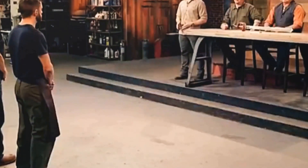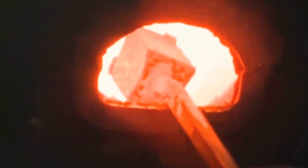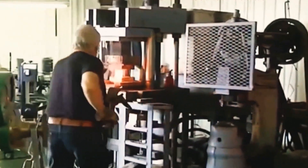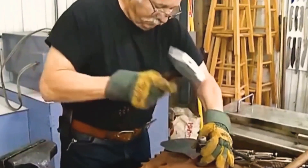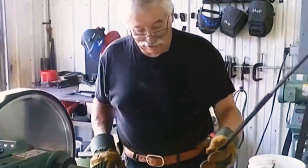Ben went home and hammered the Damascus steel blank straight away. Just in case of any mistakes, Ben hammers a large steel blank first, then a smaller one for a hardening test — that way if anything goes wrong he can correct it. Meanwhile, Wilbur, after getting the gauntlet design drawn up, straightened out a big piece of steel and made the gauntlets while forging and heating them. After hammering out the blade embryo he did meticulous grinding — but unexpectedly, as soon as he ground it down, he found a flaw. If it couldn't be solved it would have to be reforged. Time came to the third day.